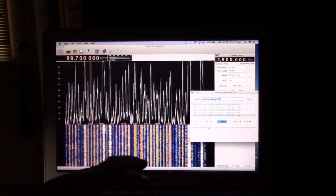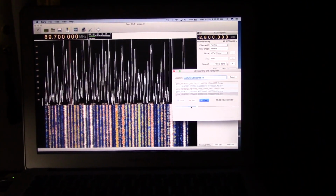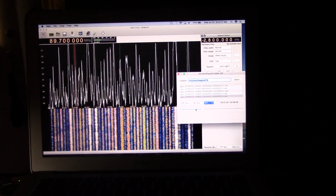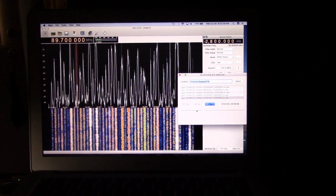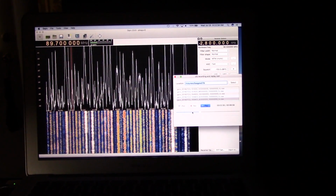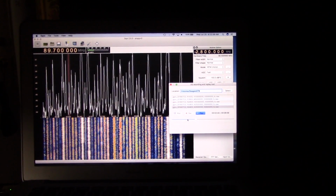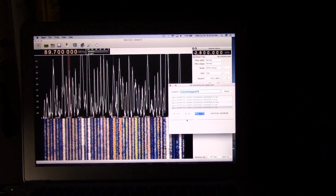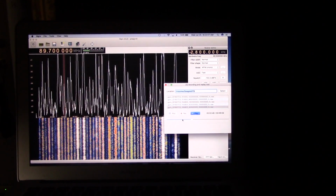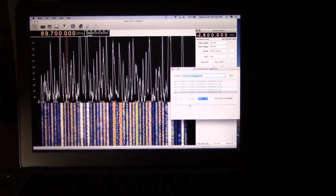online at kmsu.org. Now, you heard that. That was a really nice one because we had South Dakota Public Radio first, KUSD, and then we got a Minnesota station. And that's a classic example of two fairly strong signals swapping. Because of the capture effect on FM, as soon as one signal gets a little bit stronger than the other, the demodulator locks in on it and more or less completely shuts out the other one. And so there was a case of logging two stations in one shot.